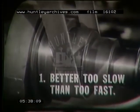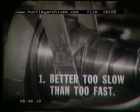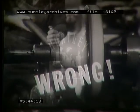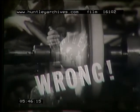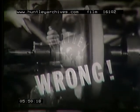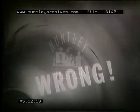1. Better to operate the lathe a little too slow than too fast. If the speed is too great, centrifugal force will make the blank stand out from the chuck and require so much tool pressure that excessive thinning will result, if not rupture.